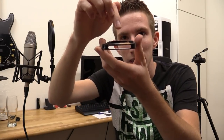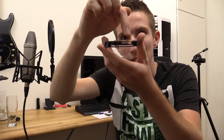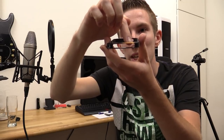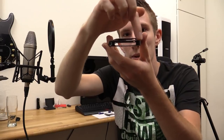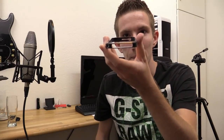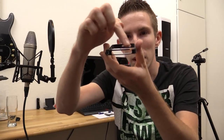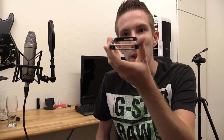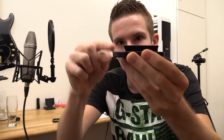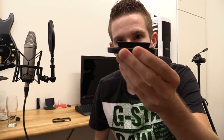It can actually still be printed because when the slicing software is making the print ready, it can fill in what is called support material. And that will just put a very weak structure in underneath here, so it has something to build this on top of. And that can be broken off when the print is finished. But it will still be visible afterwards, so you can't use it where there is a lot of detail or something that you want to be pretty. As long as we have a good angle here, it can just print on top, so for this we won't need any support.